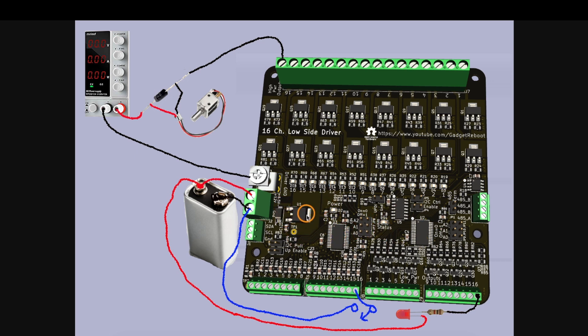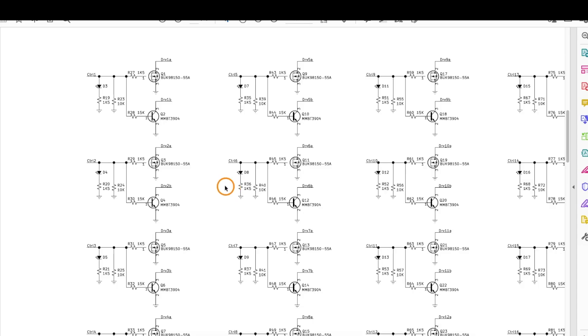To help minimize power dissipation, since there are a lot of LEDs on this board, I chose current limit resistor values to keep the LED brightness adequate while saving a few milliamps across the entire board when all LEDs are on. If I use different LEDs, I may have to recalculate these resistors based on how bright or dim the new ones are.